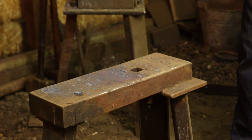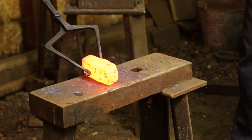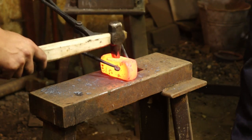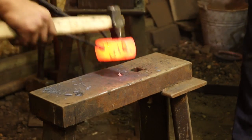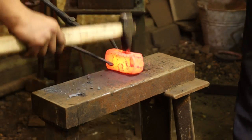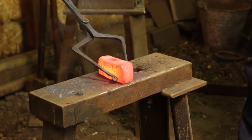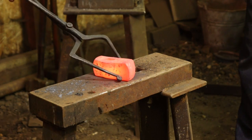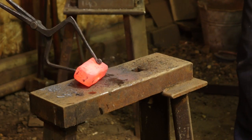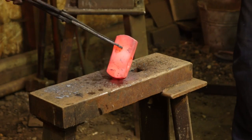So you'll notice I'm keeping my tool really nice and cool, to the point that when I dipped it in my wax, and I use a wax with graphite as a lubricant and as a coolant, it's a nice slow coolant, it did not even melt the wax. That's because I'm keeping the tool cool. But here's the thing, if you want to preserve the life of your punch, and you want to have the best chance of getting centered holes when you're working with a striker all by yourself, take that punch out of there and blow. Makes it 10 times easier to punch a hole. It means you can observe the results of each blow. You see it stuck and gets real hot when it sticks. Punch stays in good nick. This punch has probably done, at this stage, almost 100 holes, and I have needed to redress the working end maybe 3 times.